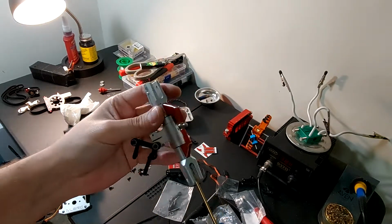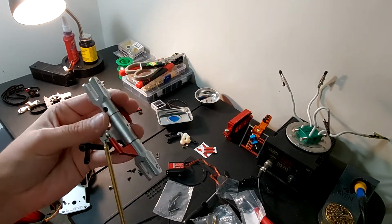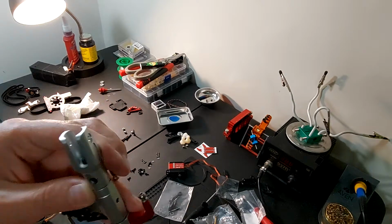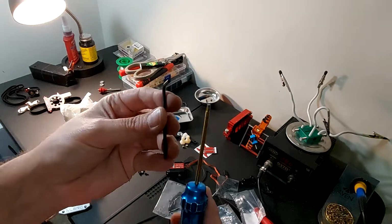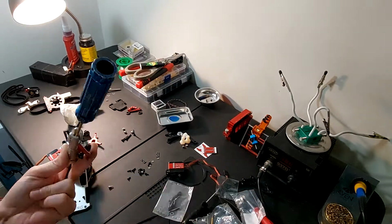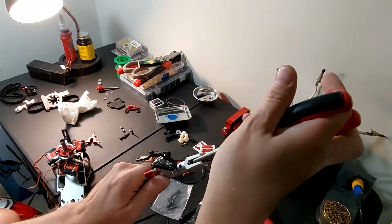Now when you take apart a head, anyway, tightening and loosening these two screws, realize the feathering shaft is just one shaft in the center and it's all bearings, so as soon as you move one, the other one is just going to sit there and spin, so you have to have a wrench on both sides. So myself, what I do is I use an Allen key and then a hex driver. So we'll go in here and grab it.